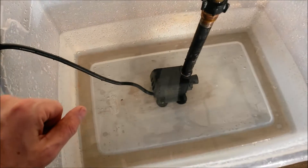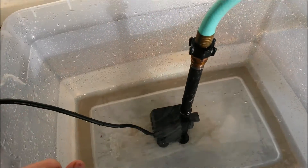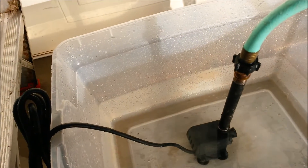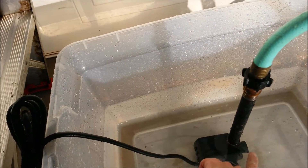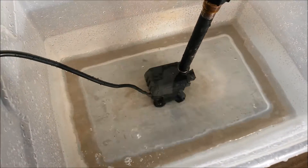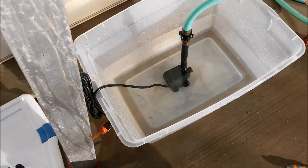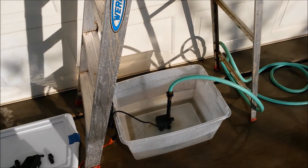Overall it's pretty impressive for its size — it's really quiet and seems to be constructed really well. The rubber feet work pretty well and I like the fact that you can hook up any standard half-inch NPT fitting. O-rings on all the fittings. Comes with half-inch, five-eighths, and three-quarter-inch barbed fittings. You can use it submersed or inline. Overall I'm pretty impressed — I think it'll do the job. I'll post a video update if it has any longevity issues. Be sure to subscribe and use my links in the description below.